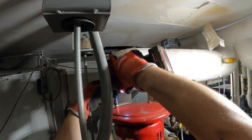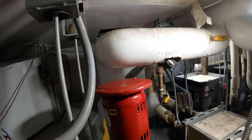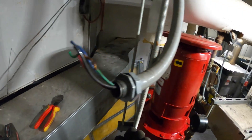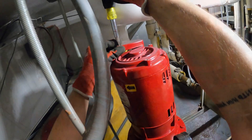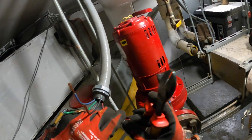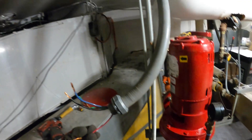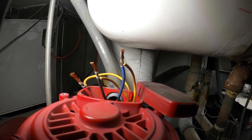Let's get this off and get to the electrical — wire this up. Saturday, overtime. Here we have our electrical connections. Let's strip these back and make our connections. This is three phase, 208. You can pretty much put the wires anywhere, but you've got to make sure the rotation is correct. Follow the arrow on the motor and the pump. We'll watch the shaft. Wire this up and turn on the power to test rotation. If the rotation is good, we're going to close it up.